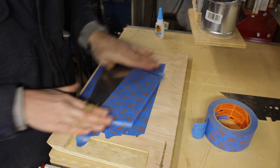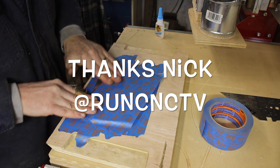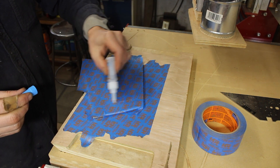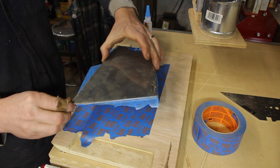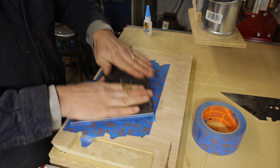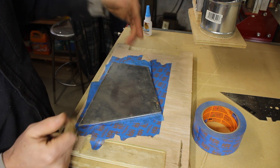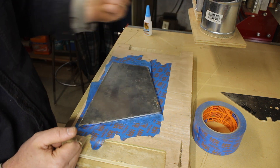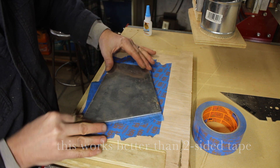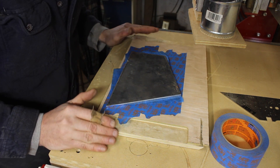This is a little technique I recently learned that works pretty good — my buddy at RunCNC taught it to me. I used super glue on it pretty liberally, then stick them together. This needs to sit for a second. Now it's clamped down and I don't have to worry about putting any clamps on it, so I can cut all the way through and then just pull the tape off of each surface — tape stuck together with the glue.